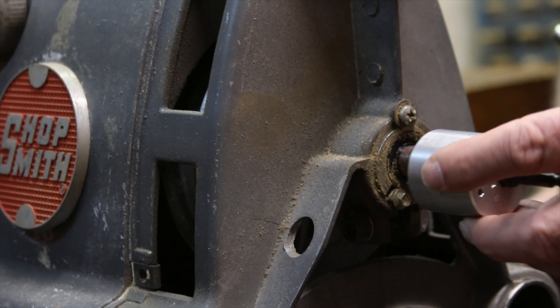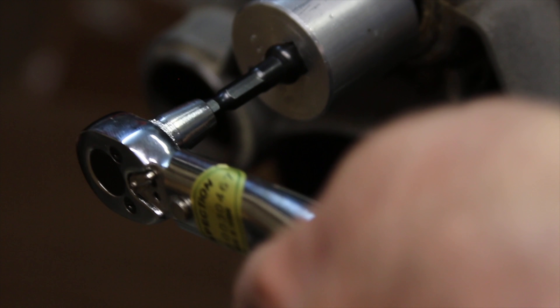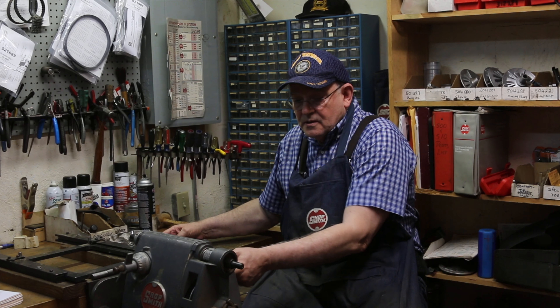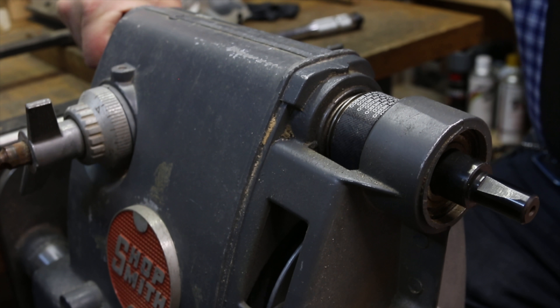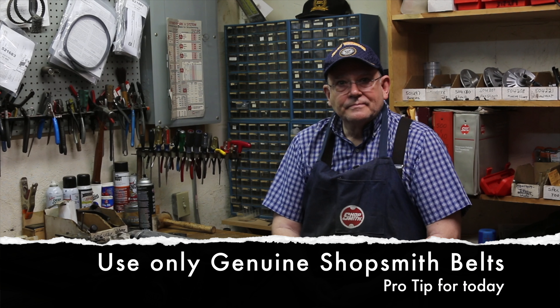I got it and installed it on my machine, and the belt literally was loose. We tighten the poly V belt with this adapter and an inch-pound torque wrench — you tighten it alternately — and you can press it in here for an eighth inch of play. But to test it, I put my fingers here, and you can see it on the sheave: this upper quill is just slipping. It's not tight.